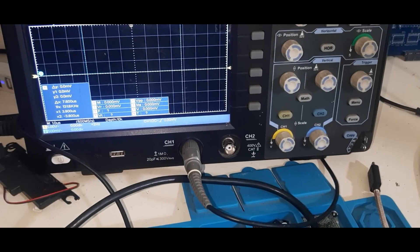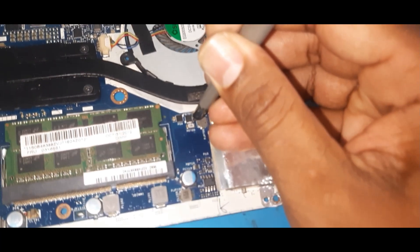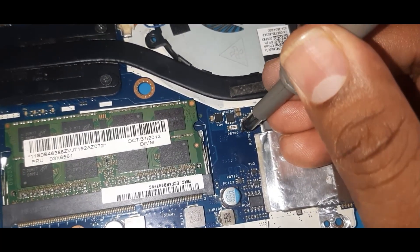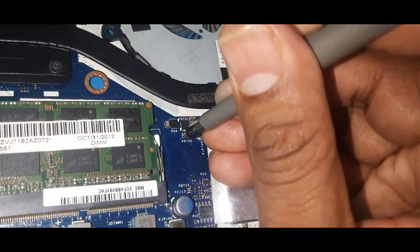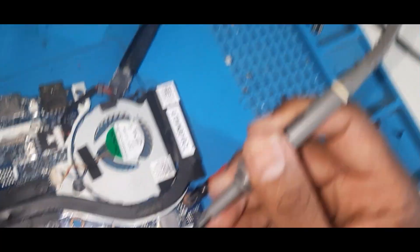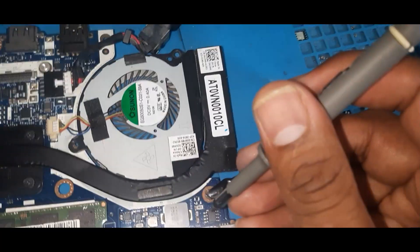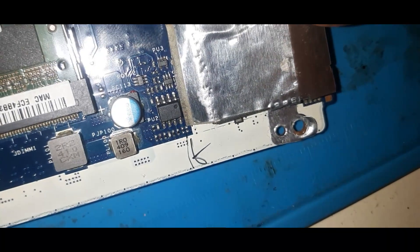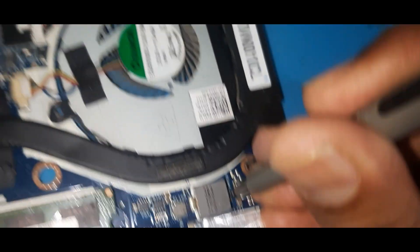The gate for the second MOSFET comes from CD13301. At the gate there is no voltage — let us check in the schematic why. Anyway, the voltage comes to CLR PR700, which measures 19.5 volts. The battery CLR PR716 voltage is 13.48 volts. This coil has 13.48 volts — this is the source I described. Here is the boost coil; the boost coil voltage is 19.5 volts (that is phase 1). One more boost coil is there — the power source coil — which is 13.5 volts.